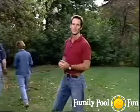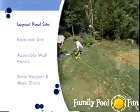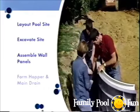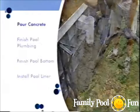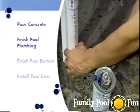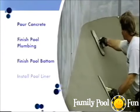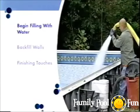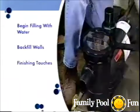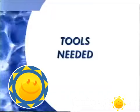Here are the key steps to install this pool system: first, initial layout of the pool; then excavate the site; assemble the wall panels and steps; form the hopper and main drain area; pour concrete in the hopper and footer around the wall base; install the pool's plumbing; finish grading the bottom and apply the sand-cement mixture; install the pool liner and begin filling with water; backfill behind the wall system; and finally finish installing the filter system.